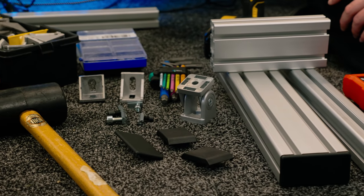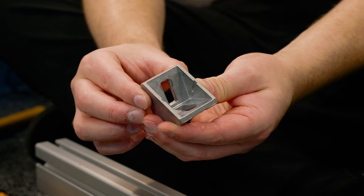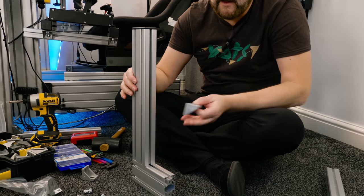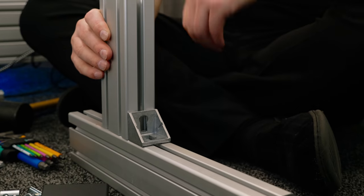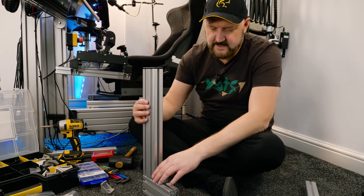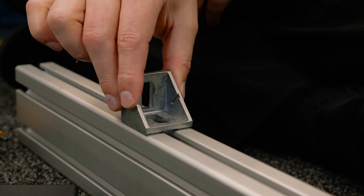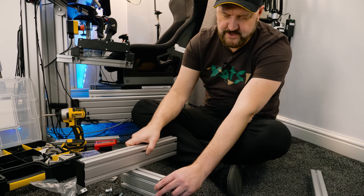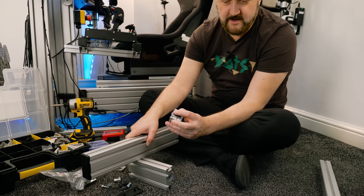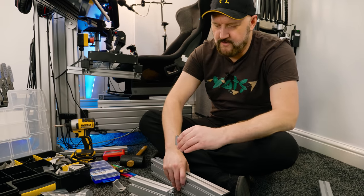So what's the reason for the grooves and how does it all work? Effectively you have these things called gussets — a gusset forms a joint between two pieces. If you wanted to join one piece to an upright you have this gusset, bolt into the two sides, often on both sides, and that holds it very rigidly. The gusset has little tabs to stop it twisting; if you want to mount transversely those tabs won't work horizontally, but you can just break them off with a screwdriver and it still works.